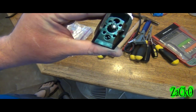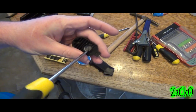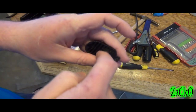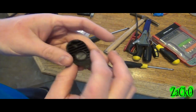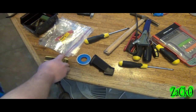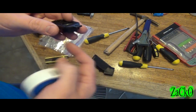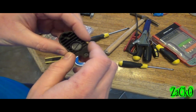Another issue I got here is this is extremely loose — I am not kidding, I can use my fingernail to turn that thing, it's very very loose. You can use some plumber's tape — this is the Teflon type — just pull it out, put it around, and put it back in.